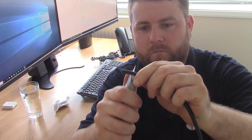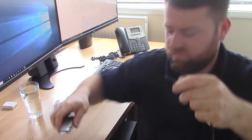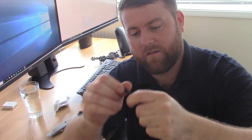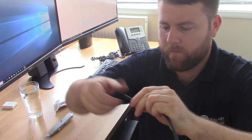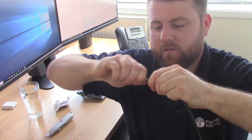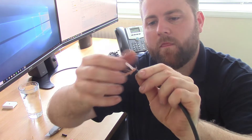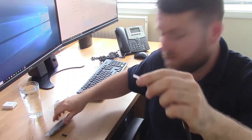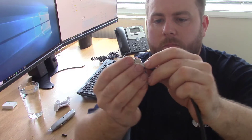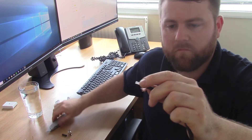So we're going to prepare a little bit of the cable — just over an inch, or two and a half centimetres. We're going to reveal the inside of the coax cable. We've got the ground shield and we've got the dielectric in the middle, which is just to keep the separation between them. You can see how far you want to cut in, because the plug would sit like that, and then we've got the inner pin that's got to fit in.